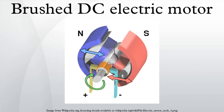One simple solution is to put a gap between the commutator plates which is wider than the ends of the brushes. This increases the zero torque range of angular positions but eliminates the shorting problem. If the motor is started spinning by an outside force, it will continue spinning. With this modification, it can also be effectively turned off simply by stalling it in a position in the zero torque angle range. This design is sometimes seen in home-built hobby motors, for example for science fairs, and such designs can be found in some published science project books.